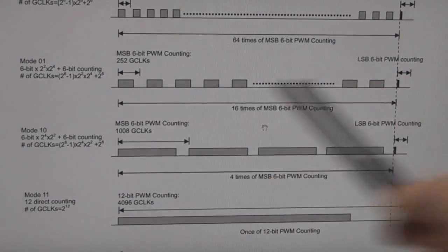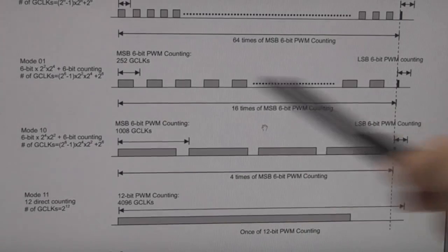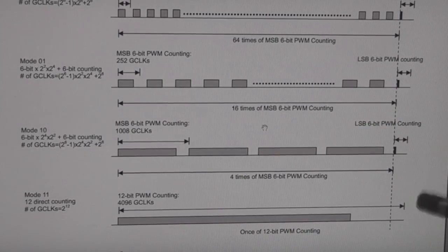So it basically distributes the fine PWM across all the pulses, which means that your actual frequency is quite a few kilohertz, which is really good if you've got displays that mustn't produce any flicker on video. Obviously that doesn't apply when you're doing a matrix, but if you're driving just single LEDs with these, that's a really big advantage over more conventional LED drivers.